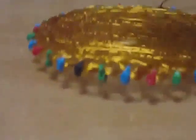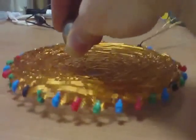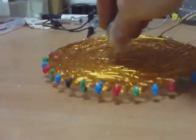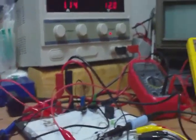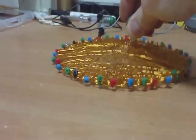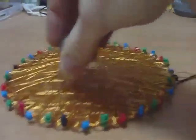One interesting thing about this coil is, if you take a magnet like this one and move it around, this coil tries to center itself or follow the magnet and center the magnet. It is running on 12V and around 1.2A on 11 Hz. Let's put it on the other side and flip the magnet — you can see it always tries to center the magnet or move itself to the place where the magnet would be in the center.